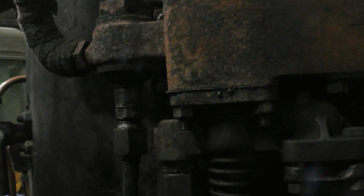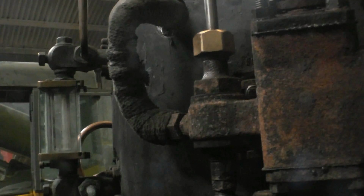This is the steam regulator. That's actually the throttle. These are the pipes from the steam superheater which come down into the regulator body. That's the main steam pipe that goes down into the engine. This thing here is a foot release valve. When you're manoeuvring the wagon, you can press that. It lifts this poppet valve and it dumps all the steam out of the line, which means the engine stops. This valve here allows steam into the water injector. That's wet steam from there into that valve. You open the valve and it allows the steam into the water injector, which injects water into the boiler.